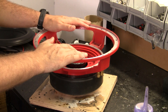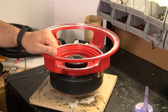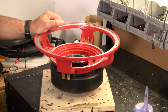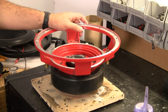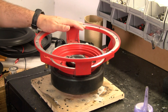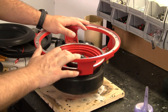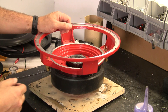This one had cotton spiders, a spacer between them, a single spider on the bottom, and a single spider just above that spacer. The leads ran in between the spiders down to the two terminals, and it had a rubber surround. Rubber does fine for long-term longevity and UV resistance, but the rubber surrounds tended to be not very rigid and would get floppy. When the spiders inevitably got floppy, it could get very sloppy and eventually kill it.